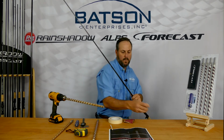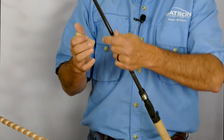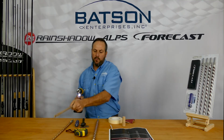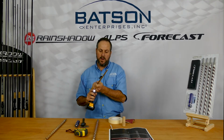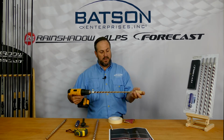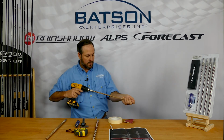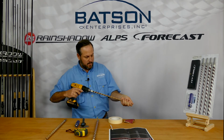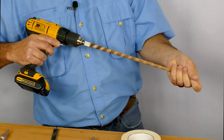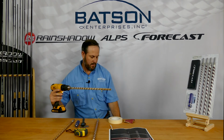Okay, next foregrip. I'm going to have to ream that. It's going to go right there. This one here has a little hole in it. We do have a smaller reamer, but we don't recommend you put the small reamer in the drill, so I'm going to use this medium here. The tip is a little bit large, but it'll push through. Just take your time a little bit when you do it. Should do it.